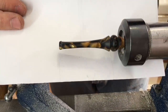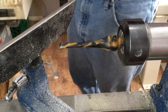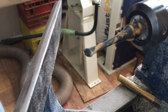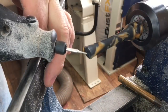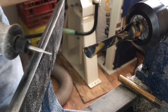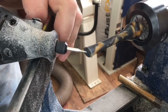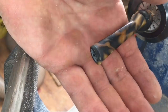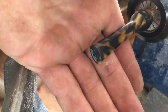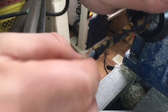I'm doing some refining sanding with 220 grit using spray adhesive to glue a strip to a piece of scrap wood, giving nice control and a flatter surface. The sanding is quite a lengthy process but if you take your time you can get accurate results. You can put little details in — like a small bit up here to help it stay in your teeth — with a slight backwards taper for some pizzazz. I'm going to cut a little slot in the front of the stem, which will help spread the tobacco smoke out as it comes out, since tobacco is for tasting. I'll use a folded piece of sandpaper to clean up the inside of the slot so it's smooth and easy to clean.